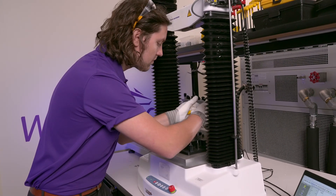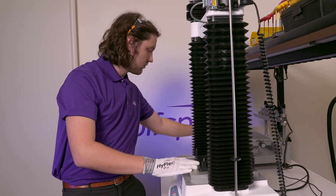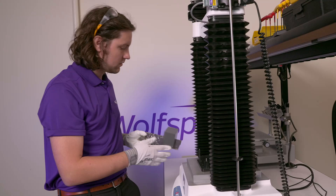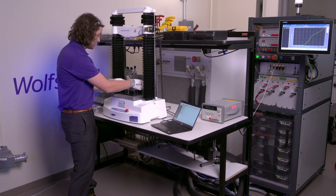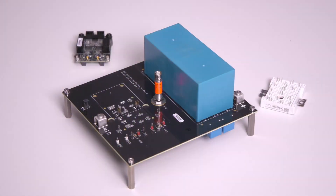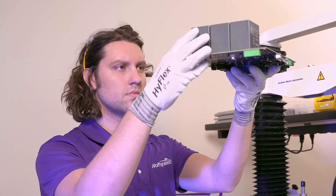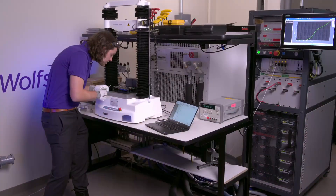Here we see the complete recommended press-in setup, including the requisite equipment, tools, and fixturing. Please keep in mind that the layout of your board and its components will vary depending on your application. Proper PCB fixturing is critical for a successful press-in. Each PCB and application are different, so tooling must be designed accordingly. Determine which components will be on the board during the press-in phase to avoid interference in fixturing.